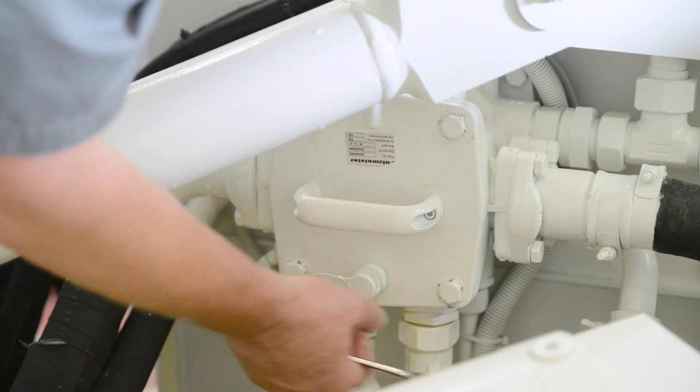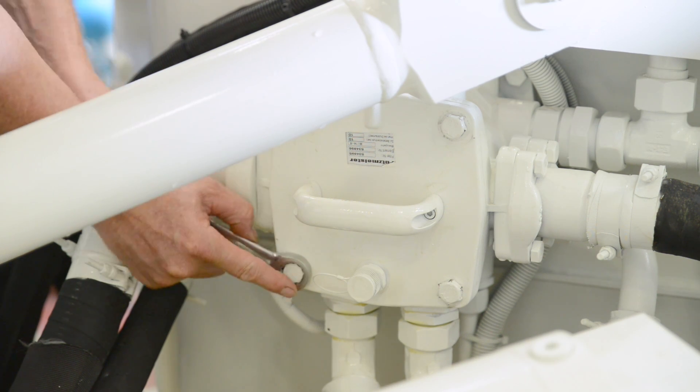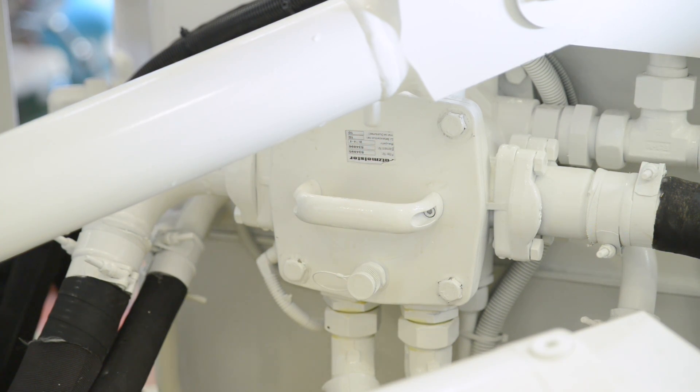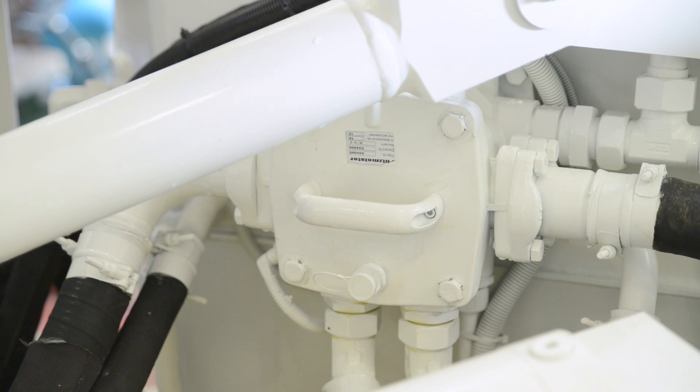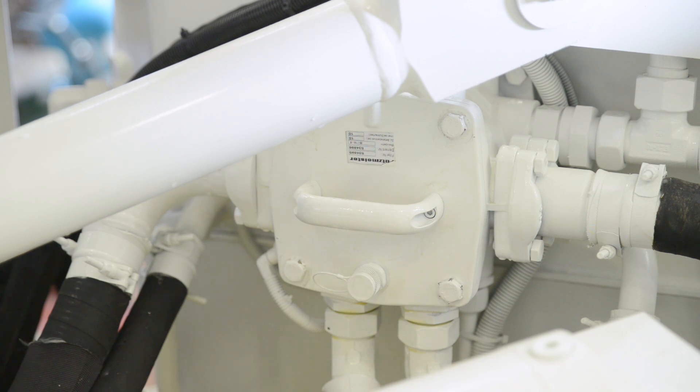My cover for the check valve is closed and my four bolts are back on and tight. If we were to just stop here and run our concrete pump, we would cavitate the hydraulic pumps. The standard Putzmeister old-school filters were self-flooding, which meant when you pushed the filter in it opened the tank and would fill the filter chamber all by itself. But this filter is not that style — this filter we have to pre-fill. If you do not, you will destroy your hydraulic pumps.